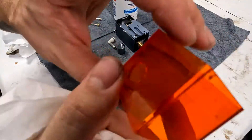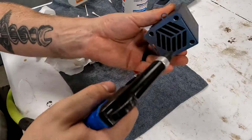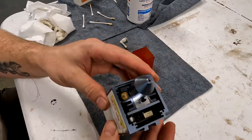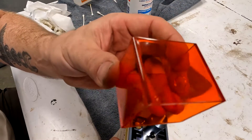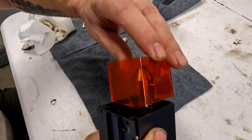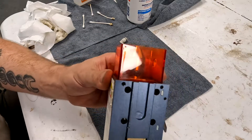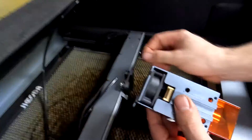Now this is optional — if you have access to an air compressor, blow everything out. This is set to like 15 to 20 pounds of pressure, so there's not a lot of air blowing through. I'm not blasting it out, but you just want to make sure all the alcohol is dry and there are no other pieces of debris. So we're going to reassemble this basically the way you took it apart. Put my air nozzle on first, and you'll see a couple of dents in the plastic cap — that's where your set screws go. Make sure you turn it so you keep sending it in there. It will fit the other direction, but you've already got dents where the set screws are, so put it back the way you had it. Tighten your two screws — don't over tighten them and crack your lens, just snug them up. Then I'm going to screw my air assist back in and then we're ready to put it back on the machine.